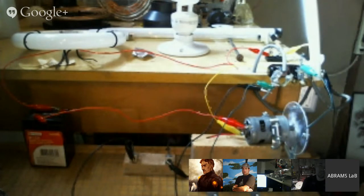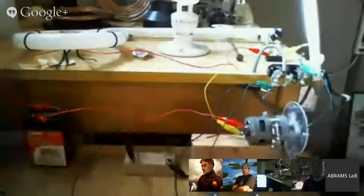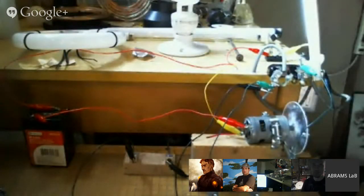So yeah, I'll have to experiment more with that stuff. But what I'm trying to do is get balanced capacitors, and I've been trying to make balanced capacitors, and then what I keep finding is I'm having tons of losses on the outside, besides cracking bottles, where it's basically acting like a top load. You can see them just getting excited and arcing along the glass.